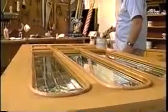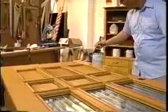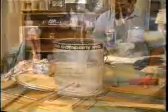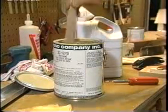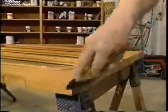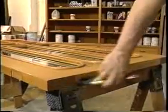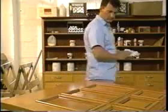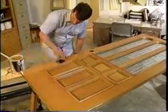While any number of quality finishes are available, we've chosen to apply our second coat using a polyurethane finish. You can apply this finish by spray or brush, depending on your finish manufacturer's recommendations. For optimum penetration of the finish into the door, some manufacturers recommend thinning the first coat of finish. It's important to properly finish all surfaces of the door. Cover the edges and ends with each and every coat of finish you apply to the door's exterior. Always make sure the doors are dry before adding additional coats or hanging the door. You need to apply more than two coats of finish for optimum results. Three coats will help prolong the life of the door.